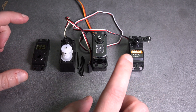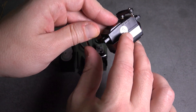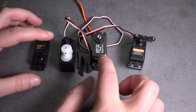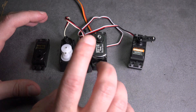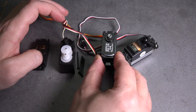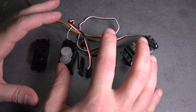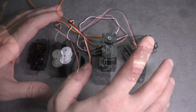The second thing I want to discuss is whether your servo is waterproof or water-resistant. On this Spektrum, you can see a water symbol indicating it's water-resistant, and same with the Reefs — these are all water-resistant. Keep in mind it is water-resistant and dust-proof; you don't want to run them underwater, but they will handle going through a stream. Because they have seals — a gasket between the two body halves and a seal at the output shaft — they're dust-proof too. Even if you're not running in water, if you're in a lot of dust or soot, it's probably a good idea to get a water-resistant servo.